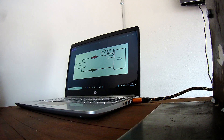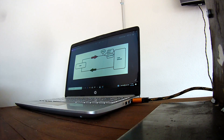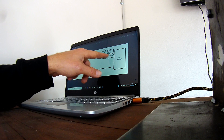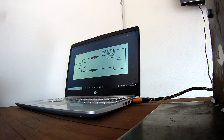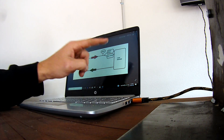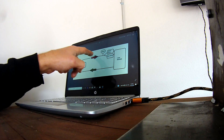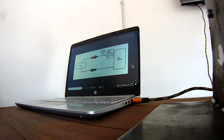Because the simplest answer is not always the best and we like making things hard for ourselves, here's our second diagram with some more components added. The first is a ball valve, which will act as essentially a relief. We can set the needle valve to a set restriction — setting a standardised load — and relieve that pressure if, for example, we want the engine to run with no load to warm up in between back-to-back testing. The second thing we've added is a gauge — just a pressure gauge for the high-pressure line.